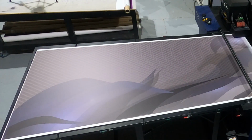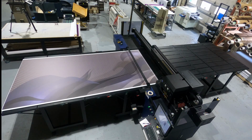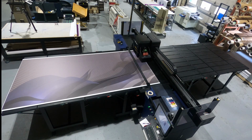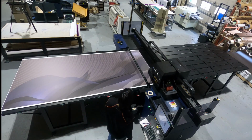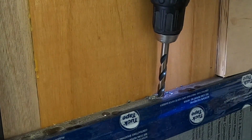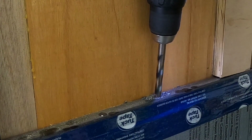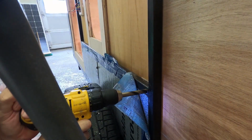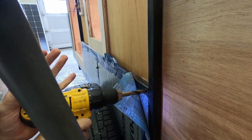Before we could install the skin, we had to get the wiring ready. And that meant that we had to drill holes in the frame, we had to pull wire and install switches, and I also installed a dimmer, which is a really nice option. One of the reasons why we built a 10-foot long trailer was to have an electrical panel / battery box and closets in the trailer itself on the inside.